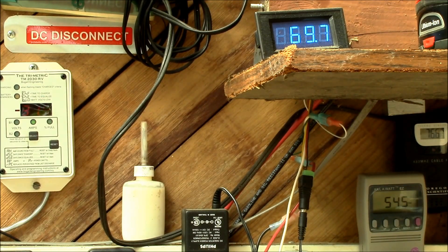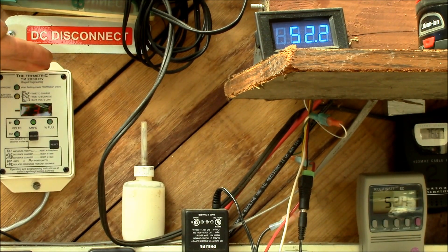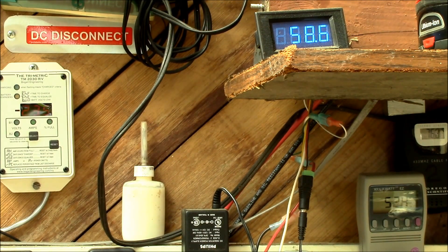It hit 31. Now I plug the capacitor in and it's dropping back down — there, it's 24, 23. It's almost eight amps difference. You can see we're at 23, 22. The watts didn't change, but even though reactive power isn't real power, it's still amps — you still have AC amps that you've got to put out.